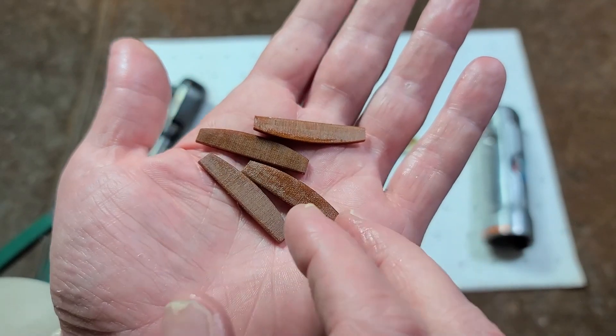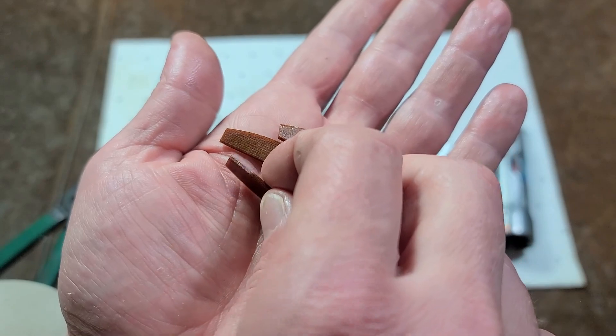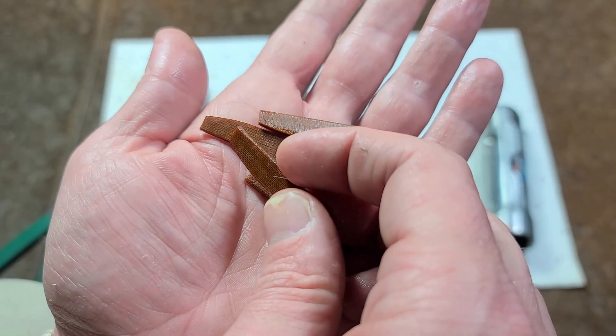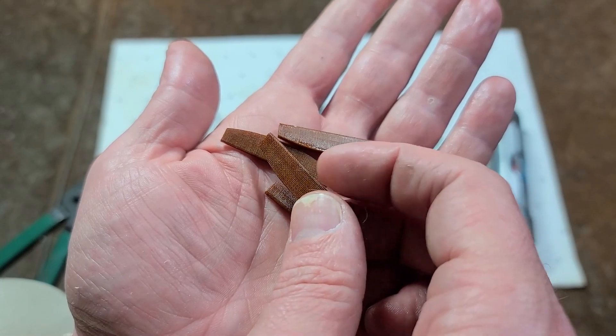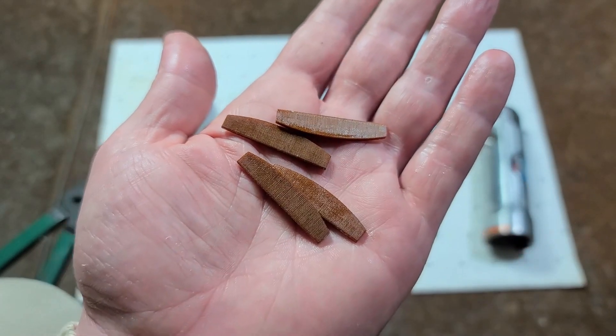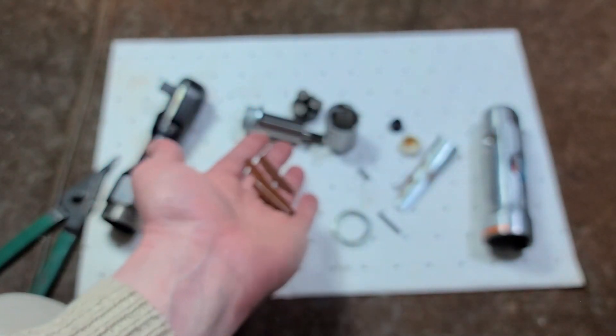Given that air tools don't see much grit or debris through the motor, nonetheless that's when air motors start to fail — it's usually because there's some kind of chip on the edge of these vanes letting air go by. Otherwise the motors just have a couple of bearings and they're surprisingly easy to fix.